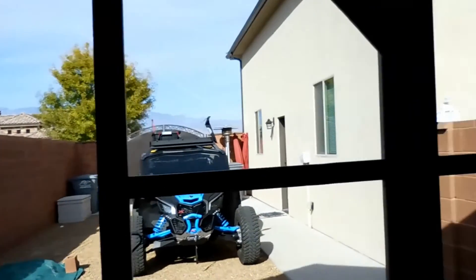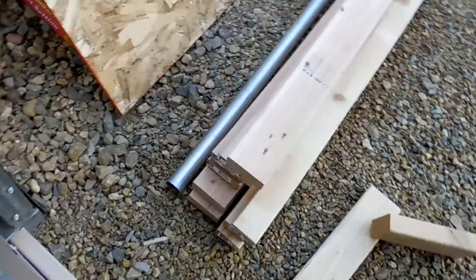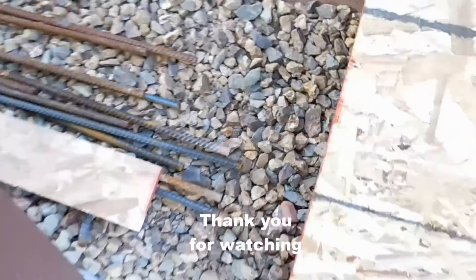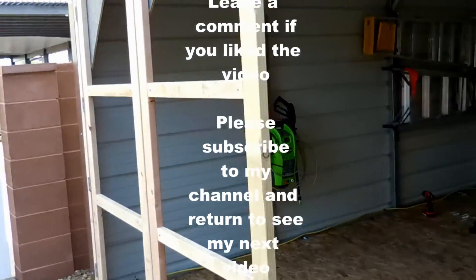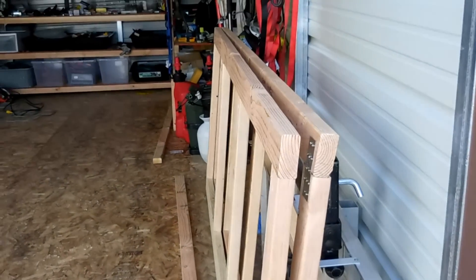It's pretty square the way it's hanging there. I'll have those four hinges, which I think is the right number to carry the weight. I need to get that side finished, then do the same on this side. Then I'll know where to sink this fence post in the ground — it might go somewhere in here. I've got a bag of cement underneath this plywood. We'll go ahead and start breaking this down, cut in those hinges, and start doing the same on this set. Then decide what the next step is going to be.